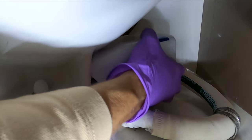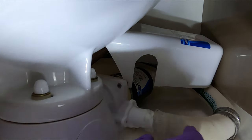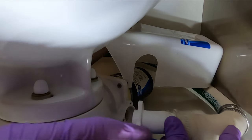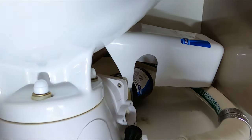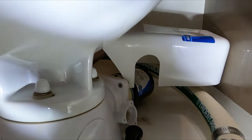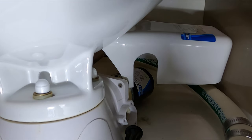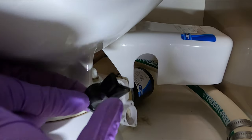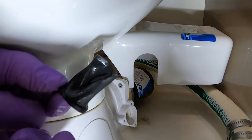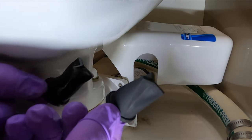We're going to make a mess. We can pull this cover off — I think this cover just pops up. There we go. Let's pull this out and see what we've got. Here's our joker valve! There's some schmutz water — gross, gross, gross. So this is the old one here, and you can see it just wasn't closing. It's pretty deformed, looks a little weird. This is the new one. Got high hopes for this new one — hopefully it will fix our problem.